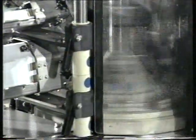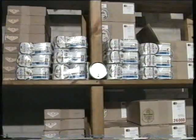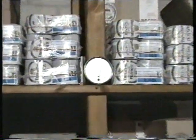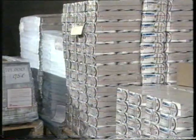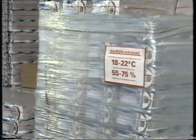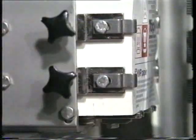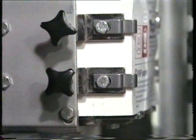Paper must combine well with the glue. If the backside of the paper is too smooth, as with lacquering or printing, the drying time of the glue is increased, which also leads to shifting in the magazine. Highly absorbent labels react strongly to humidity and therefore deform when stored incorrectly. Recommended storage conditions are lying flat at about 60% humidity. The labels should be stored at least eight days before being used. If the dimensions are not within the prescribed tolerance of plus or minus 0.25 millimeters, the label guides must be adjusted continuously.